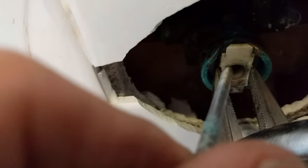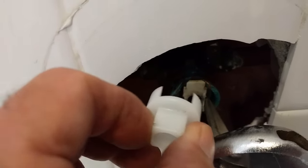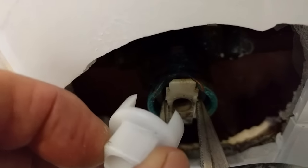So here's where we are. The shaft broke off — this has been here about 20 years, so it just broke off when somebody was using the shower. How do you get this thing out now? They also give you a little plastic piece that comes with the new cartridge. You're supposed to stick that in there and twist it side to side to move the cartridge out a little bit, because there's an angle. As you move it left, right, left, right, it rubs up against that angle cut and that's supposed to pull it out. But this plastic tool flexes so much — there's so much wiggle and flex in it that it doesn't really do anything.